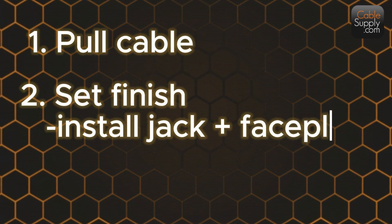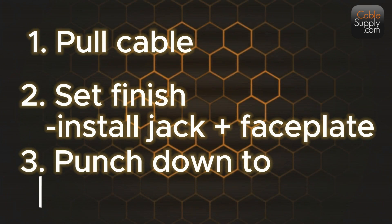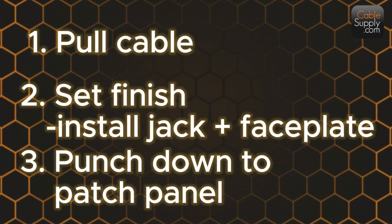What I do is pull the cable, put the jack on the wall, set the face plate — it's all ready to go — then go to the data room and punch everything down irrespective of where that cable came from. On that big install, they had an east wing and a west wing, so we separated by east and west, but beyond that we didn't mark cables. How do you identify where jack one is on which patch panel port? It's just too tedious — it takes just as long as pulling the cable and installing the jack.